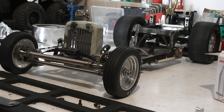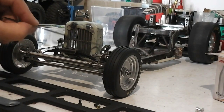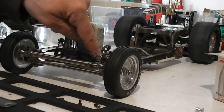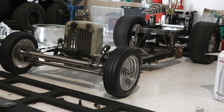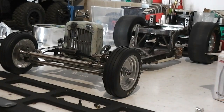It's the same principle I used when I was doing these uprights on the brackets for the tops of these shocks. I left a lot of meat on those at the bottom, and didn't cut that off until after I'd welded it on. The reason I do that is to help take the heat, because if I cut those exactly to fit, I would have just blown them out. Those of you who are watching carefully will have seen that when I was welding these, at least once the thing got really cherry red and it was about to go on me. So if you can get away with it when you're doing the little stuff, don't necessarily cut the metal exactly as you need it if you think you're welding it, because it'll disappear on you. The heat's got nowhere else to go.